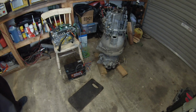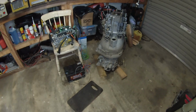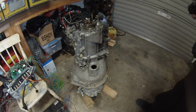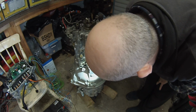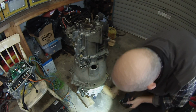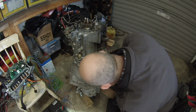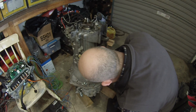Alright, so right now our motor is running at a frequency of 5 Hertz, and we can see up there now that our gearbox drive shaft flange is indeed spinning, and spinning in the correct direction, which is rather important. Now for my next trick, I'm going to get my trusty torch. I'm going to look in there through where the clutch slave cylinder would normally have been. Pardon the head view, guys. What I'm looking for, see if there's anything shaking around in there that really shouldn't be.